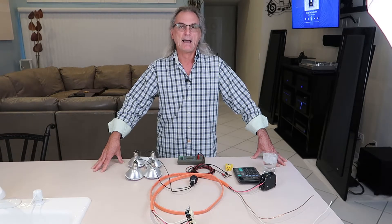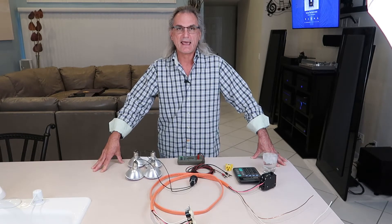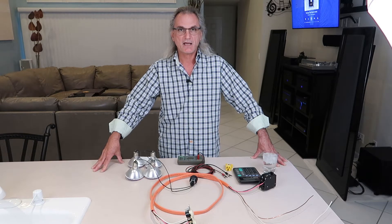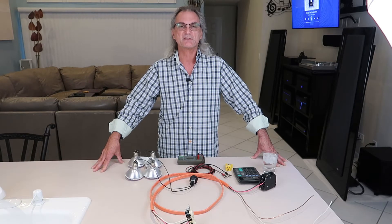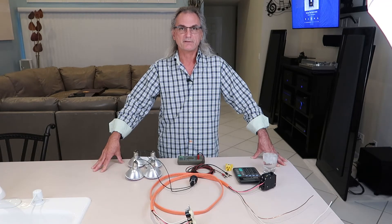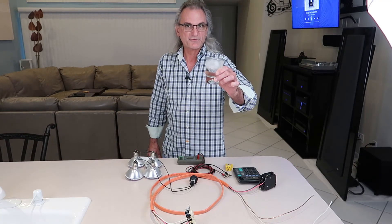That's another discussion I had with my inspector — he told me I was crazy for running 10-gauge wire and that I could use 12. I am not going to argue with the math. I ran nine 90-foot runs in that attic and I wanted to make sure I did it right the first time. Before this wiring job, my family room lights and bathroom lights dimmed with the bass — and that problem is gone now. I've got 10-gauge wire guaranteed to give me 20 amps continuous service at the outlet even at 125 volts. Do the math, trust the math — but do it at 125-volt service and it'll come out perfect.